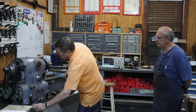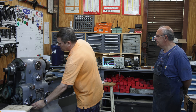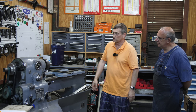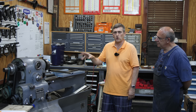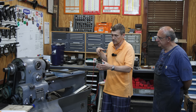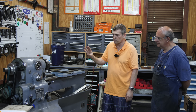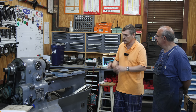We can come down to a very low speed — around 200 RPM. Coming back up, let's do a high speed reversal. The electronics realize we're stopping, clicking, and now we're switching to reverse. The drum switch is working really nicely. Coming back to standard. There was one other small change: I played a little with the IR compensation. That accounts for losing a little bit of voltage in the motor when running a lot of current through it, because the windings have resistance. I thought it got a little smoother, but I don't think that was the main change — the most important thing was just getting the wiring on the speed pot correct. It's really interesting that it worked so well when wired incorrectly, but it's definitely working even better now.